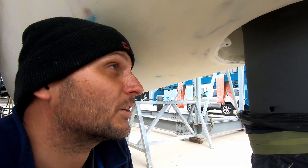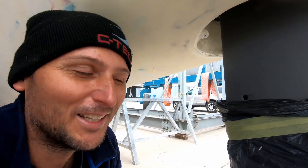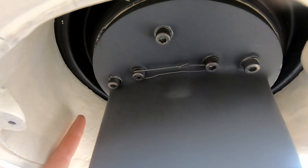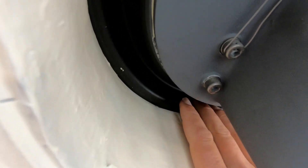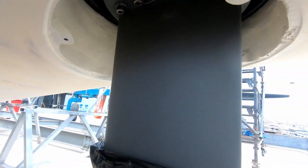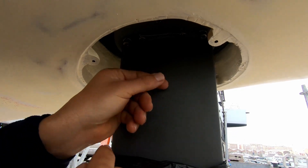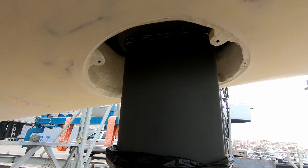I fitted the sail drive into the boat - I did scratch the anti-foul off it a little bit on the trailing edge, so I've given it a little patch up. You can see it in there - the pocket is now coated with epoxy primer. You can see the new rubber boot in there. It's surprising how much softer the rubber is when it's new compared to when it was old and perished. I've just got to finish the covers and the little rubber boot that will seal around this. Basically this will be all flush around the sail drive except for a 15mm perimeter, and that 15mm perimeter is then taken up by the rubber flap supplied by Volvo Penta.